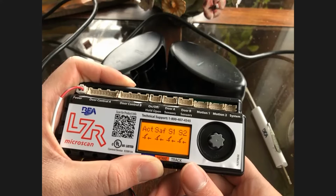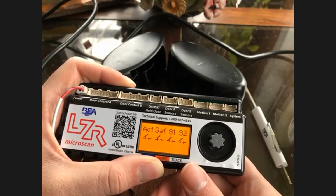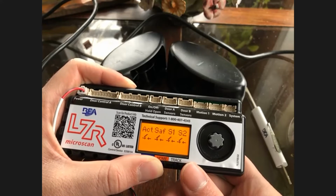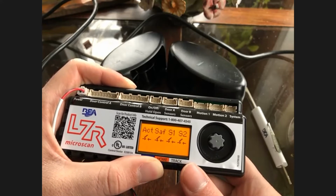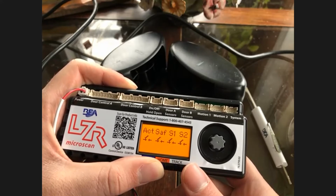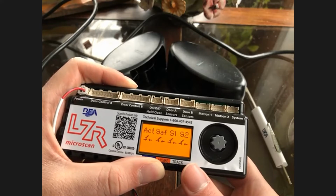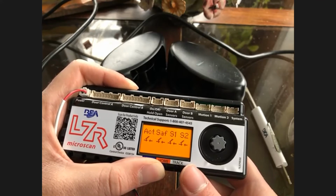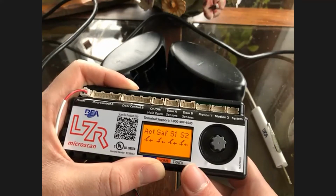But we have had some people remove a door and replace a door. And yeah, the position of the sensor changed enough to where it had to be relearned. So sometimes I can't guarantee that wouldn't be something you might have to do. But in most cases, replacing a door, if you position the sensor exactly where it was before, and if you replace the control and nothing major has changed, you should be able to kick it back up and it'll just work.